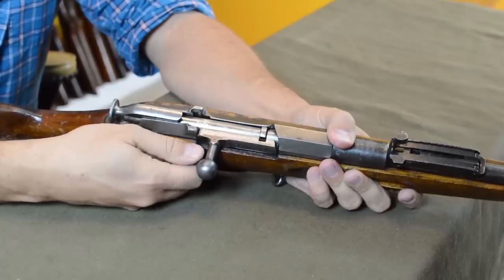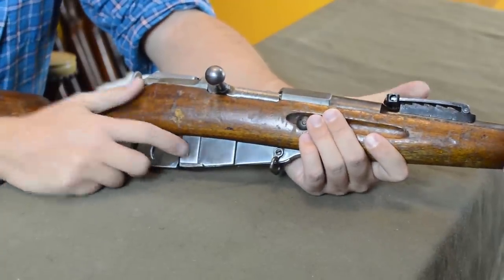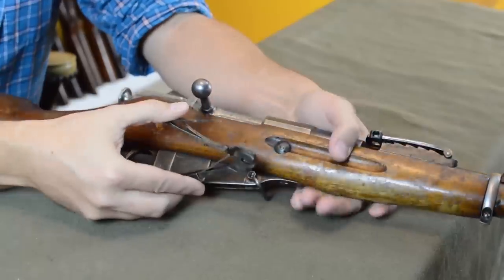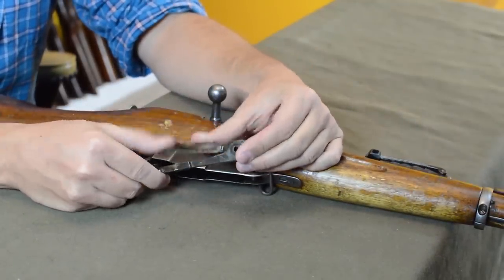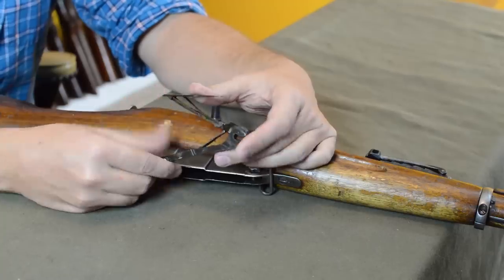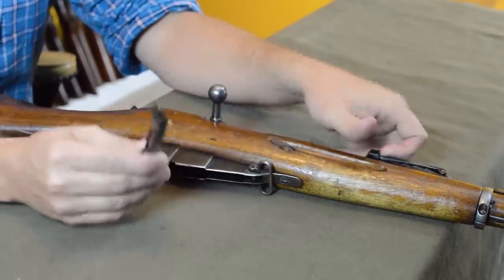So there are a couple things going on. By 1891, we already have some pretty good Mauser designs coming out, and you can forgive the fact that this is single stack. But reasonably, within just a few short years, single stack is going to be obsolete. If we look at this spring setup, you can tell this is a fairly complicated part - we've got multiple springs, multiple arms, all finely fitted in order to drive that ammo. That's going to be a problem in terms of manufacture versus later designs with staggered flush magazines, where we just have a simple flat spring, very simple, very easy to produce, unlike this.